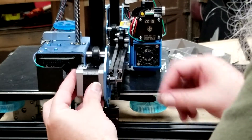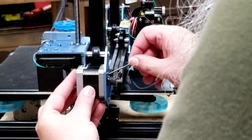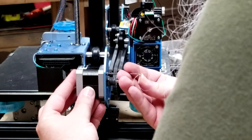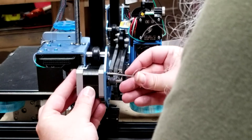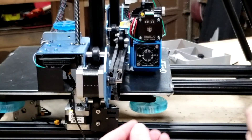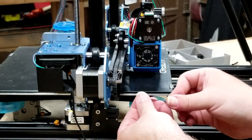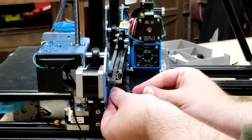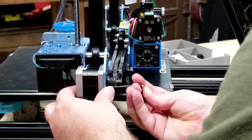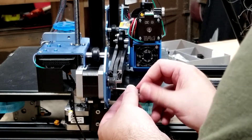These are the short ones — 6mm, 4mm. The reason I'm using these bolts is because they are self-centering. The taper on here will push it to the exact center of the bolt hole, and when it's pushed in the center of the bolt hole it will center itself within that hole.